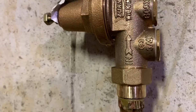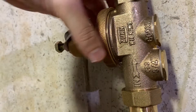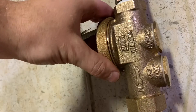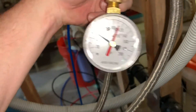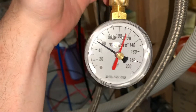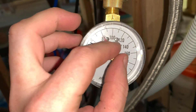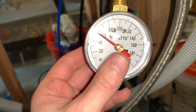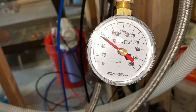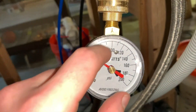It does look like I'm getting a little bit of a drip underneath here — I think that is from this unit, it must not be tightened quite all the way. Coming back to the pressure gauge, we're almost up to about 60 psi, so that's good. This is a good sign that the adjustment actually changes the pressure. My old water regulator would not change the pressure no matter how many turns I made on that bolt — and so that's also a sign your regulator is going out, if you can't change the pressure and see a real change on your psi gauge.